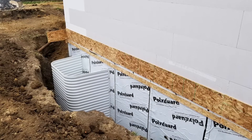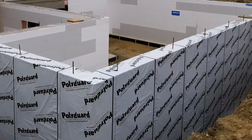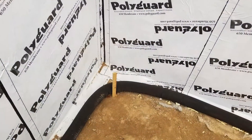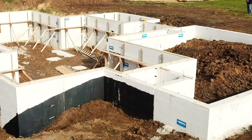For best results on basements or below-grade projects, a good quality self-adhesive 60 mil waterproofing membrane is recommended. It should be applied from grade level down over the concrete footing. As an alternate, good quality liquid waterproofing can be placed by a certified applicator.